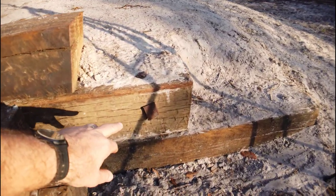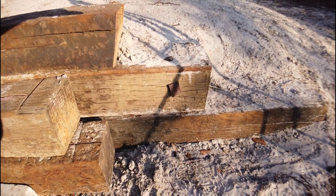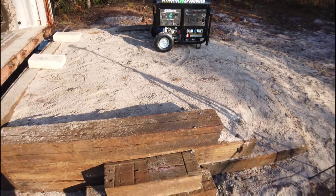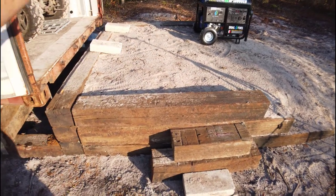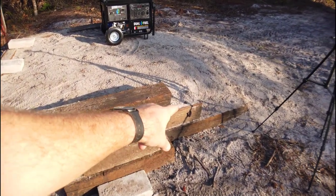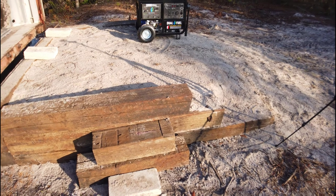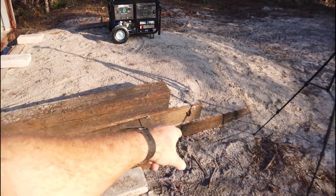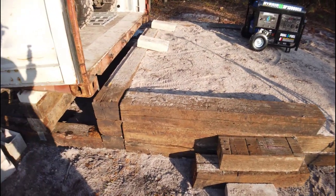The other thing I did was take a piece of rebar, run it through one end cap across and through the other side, then weld a little piece on both ends. That's going to play a significant role over the long haul — keeping the two ends from splaying out as downward pressure applies. Once this gets rained on it'll get heavier too, adding even more downward pressure. You may want to do this on the bottom course; you can't easily do it on the top because it would be too close to the surface. Having at least one of those keeps the sides from tilting and splaying.